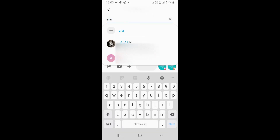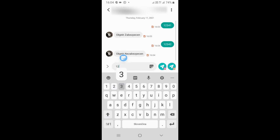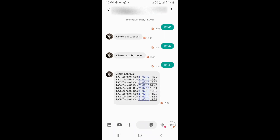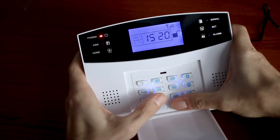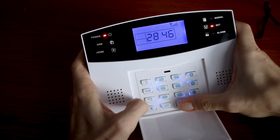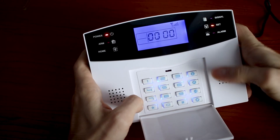In this step I will show you how you can arm your alarm over SMS. Enter the default operation password 1234 and number 1 for arm. The other command is 1234 and number 2 for disarm. The last SMS command is 1234 followed by 3 for alarm record checking. Now this is a very important step — we will change the settings password. The code is 31, then choose your new password — for example 2846 — then hashtag. Check it with 2846 and it's working.